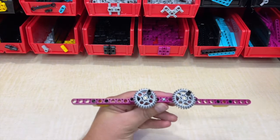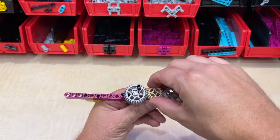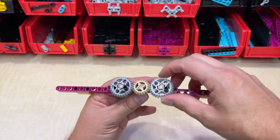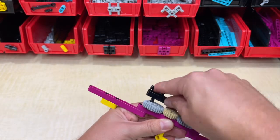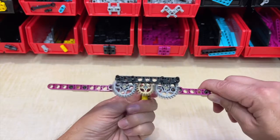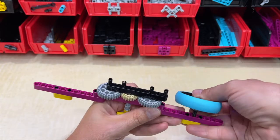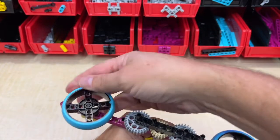If one middle gear improved it, perhaps adding two would be even better. And actually, connecting those together in a gear train would ensure that these positions stayed perfectly horizontal throughout the entire rotation. Here's an example of a coupling rod staying horizontal as the gears rotate. Now extending that coupling rod out, it can be connected to front and back wheels completing the system.